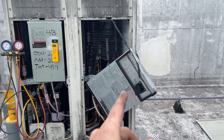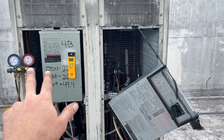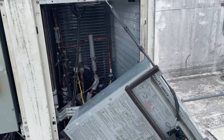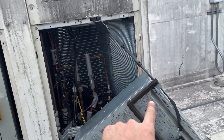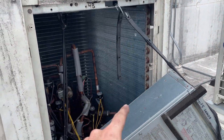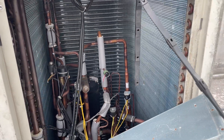There are times when you need to work on stuff on the inverter side — you have more space on the standard side, but for the inverter side you almost always have to drop this panel. There's one screw down here and two up here, then you unhook it and it comes straight down. I use a bungee to hold it. Just keep an eye on your sensor wires and solenoid wires and make sure none of them are getting too tight.